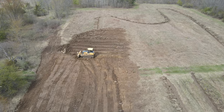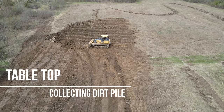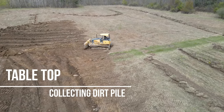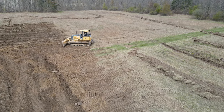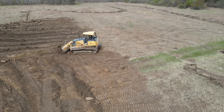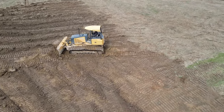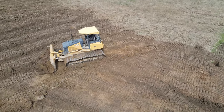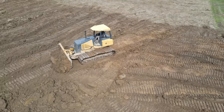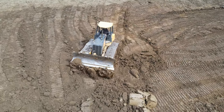And so then he came out this morning, and the first thing he did was mark on the ground with spray paint kind of roughly what he had drawn. And then he goes around and basically digs in. You can kind of see a little line here where he just tilted the blade, dug in, and kind of drew the outline of the track. And now he's going over it section by section and either adding the dirt or scraping the dirt off to get the elevation changes that we want.